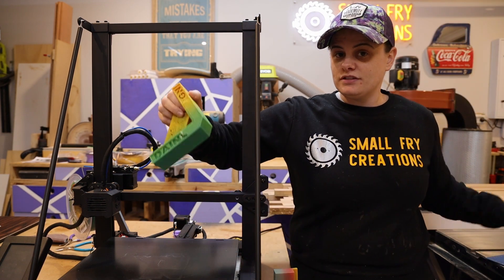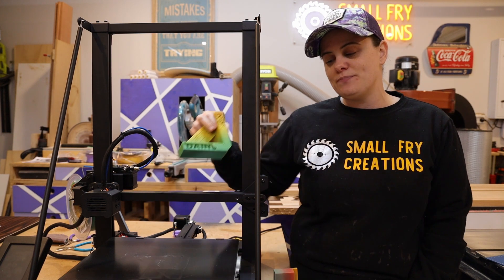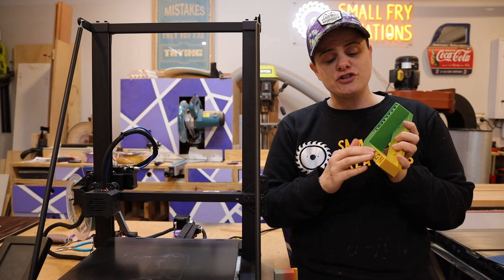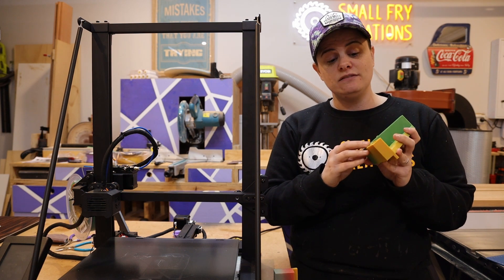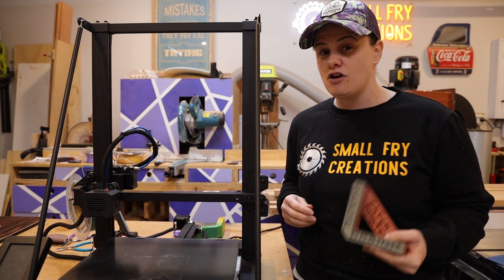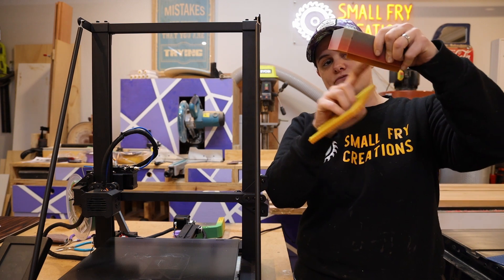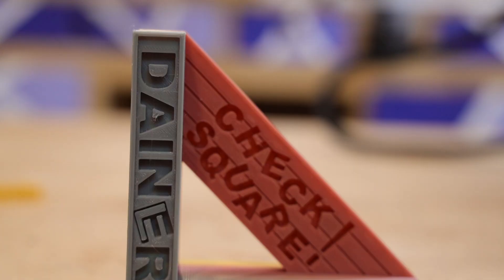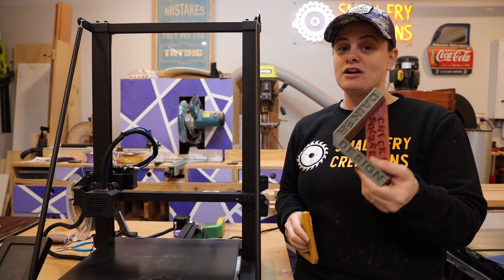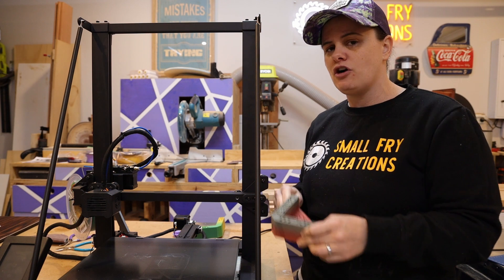The first square I printed was the green and yellow one, sitting upright on the bed because I thought that was the best approach. After 15 hours I came out, took it off the bed and quickly realized that removing the supports was going to be a nightmare — basically impossible. I got a little way in 20 minutes, but trying to remove the supports around the lettering was really difficult, and where I could remove them I wasn't happy with the finish. So I rotated the square to sit flat on the bed with the main support structure underneath because of the bar that runs under the square. It only took 13 hours instead of 15, it took about 30 seconds to snap off the bottom support, and the lettering was much cleaner because it doesn't require any supports. So when you go to print your projects, really take a second to think about how you're orienting it on the bed and how you'll remove those support structures.